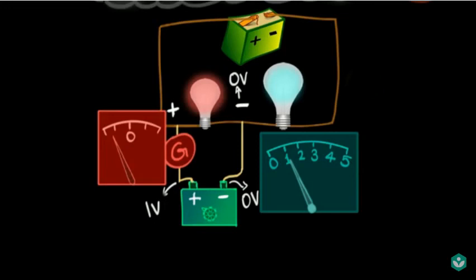And so you see where I'm going with this? As I turn up this voltage, the galvanometer deflection becomes smaller, and at one point, it becomes 0. So right now, my voltage is at 3 volt, as you can see in the bar over here, and the galvanometer deflection is 0, which means how much voltage should be over here?